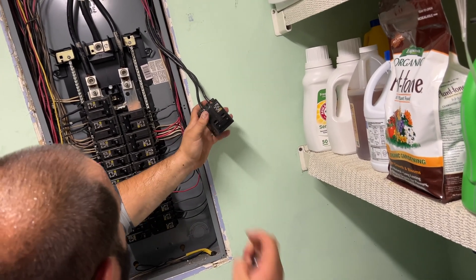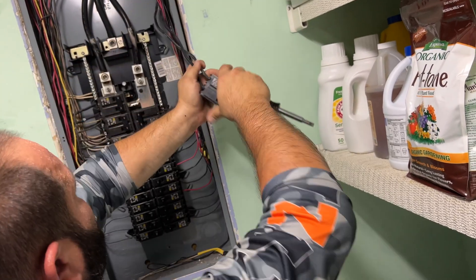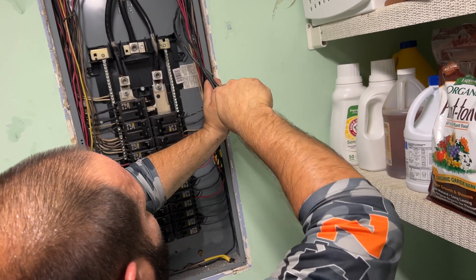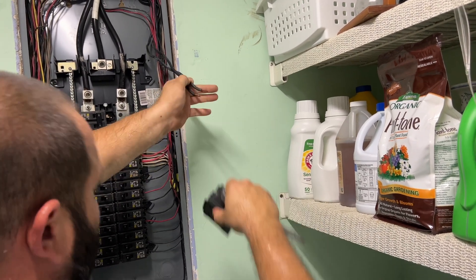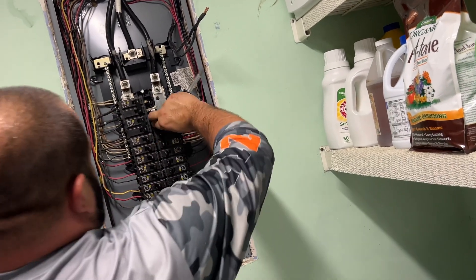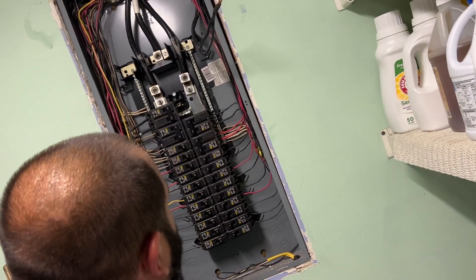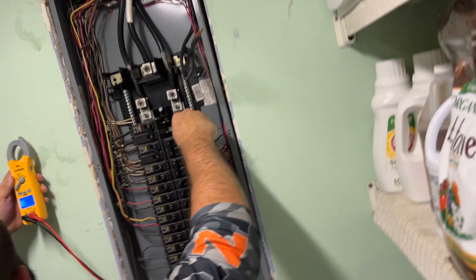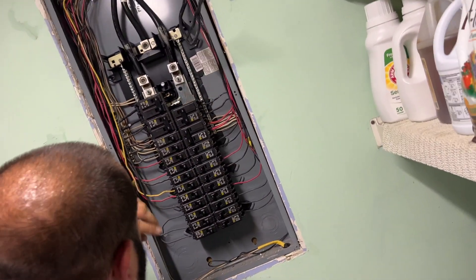That's hot, isn't it? Not at the moment. As you can see, he pulled that 30-amp fuse out with his pliers and then used a Phillips head to loosen those wires. Do you have a couple breakers in here? No, but we can run to Home Depot. Turn this one off. Let's make sure we don't have only one leg of power here first. I got 240 there — so that's good, right? Yeah. All right, so this breaker's good.